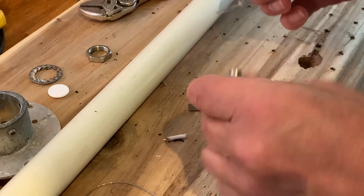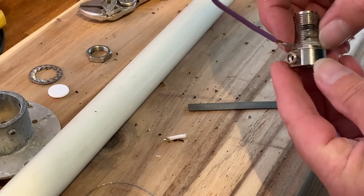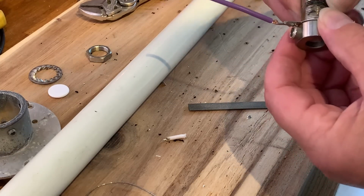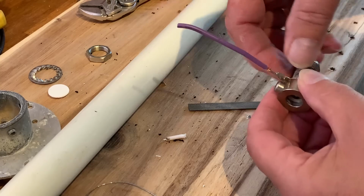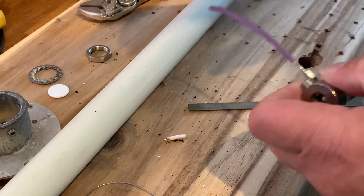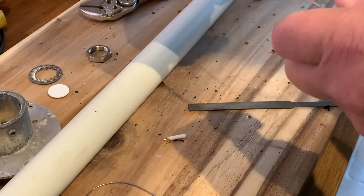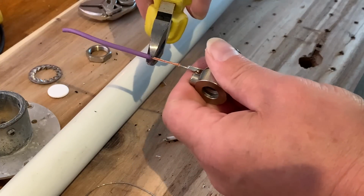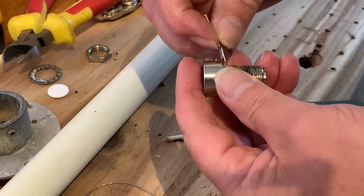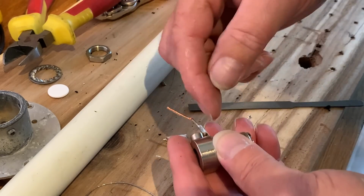As it goes through here, okay, like so. Probably the other way up because it would be neater. And I'll wrap that around the outside of the coax and solder. So I'll just quickly peel back so much of it. Here you go. So this will be soldered to the coax, the braid of the coax.